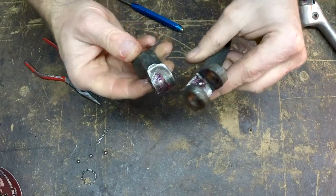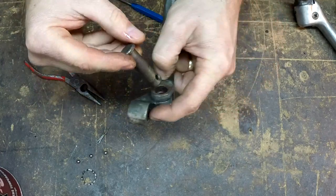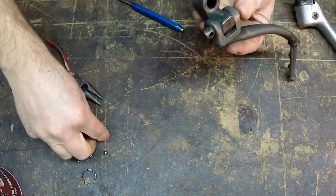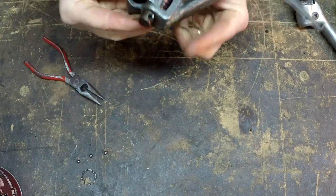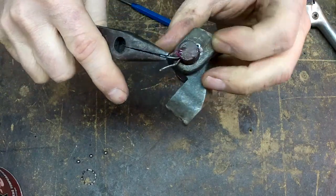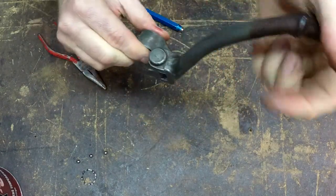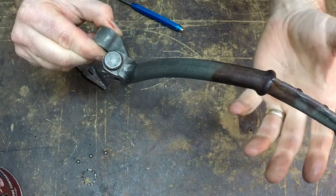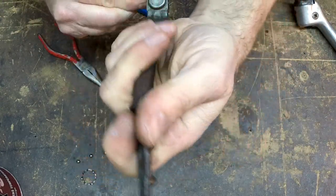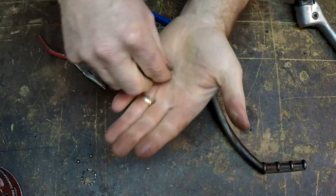Make sure we've got the right side up here — that detent hole needs to go where the detent ball is. This pin needs to come down just like so. I'm going to put this pin back in and bend it out. I've got the cotter pin back in, and now we have a nice solid detent. Comes back — that's not going anywhere. Nice, crisp detent right there. All we had to do was replace it with a bigger ball.